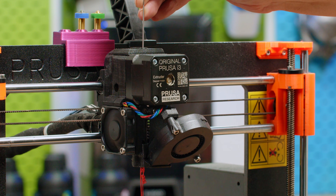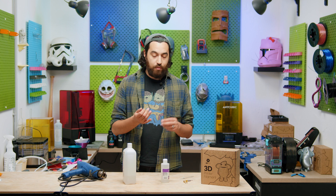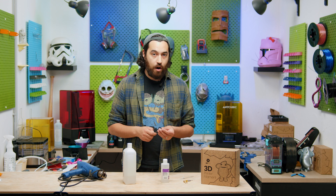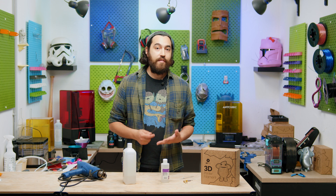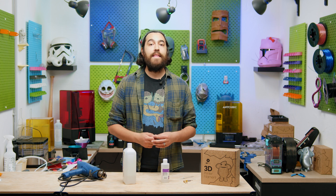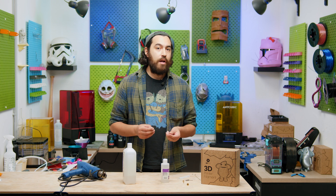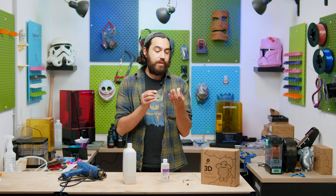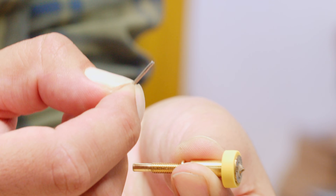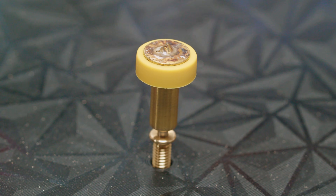To use the rod, heat up your hot end and jam it down the extruder with extreme prejudice and watch the mess fall out — actually very satisfying. However, if it doesn't work, don't keep jamming it down as you'll compact the blockage further. If you can't clear it, remove the heat break and use the heat gun or solvent approach. If you're not sure where your blockage is, thread the acupuncture needle through the nozzle — if it blocks right at the tip, the tip is clogged; if it goes further up, the issue is likely the heat break.